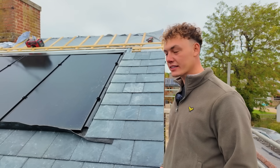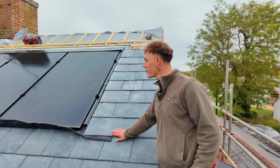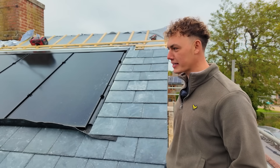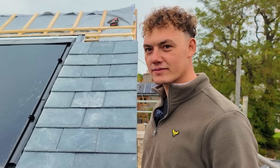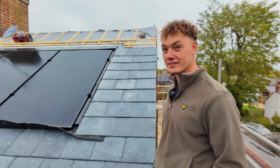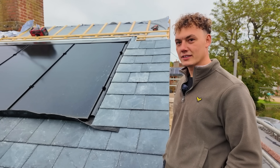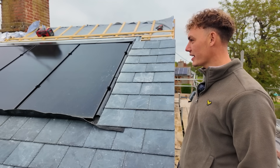So you didn't do the solar panels - somebody else did all that? No, they came in, screwed them onto the battens, and we've just come around, tidied them up, counter-battens for the airflow. I think you should counter-batten slates - especially fibre cement ones, because they sweat like mad underneath and then you get all that white efflorescence. It's one of those things that's done on the continent all the time and you never see British roofers do it. I think it's coming in a lot more now, but I'd definitely counter-batten it.